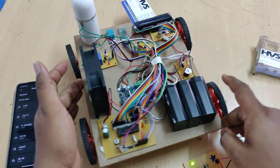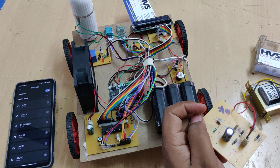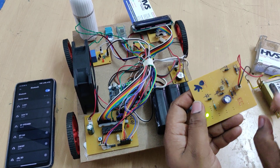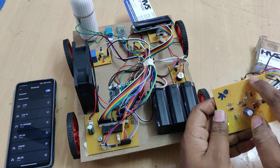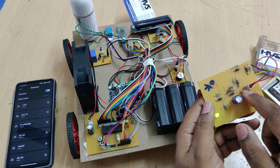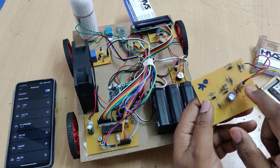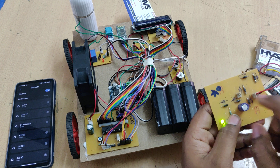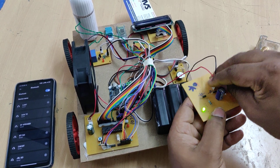To recharge the battery we have provided a charging circuit. A 230V AC input is fed to a transformer, which steps down 230V AC to 12V AC. The regular power supply board then converts 12V AC to 12V pulsating DC using four diodes connected as a full-wave bridge rectifier. A capacitor then smooths the pulsating DC into smooth DC, which is the main charging voltage for the battery pack.